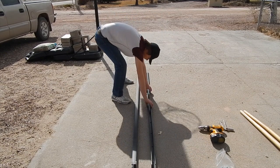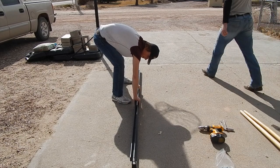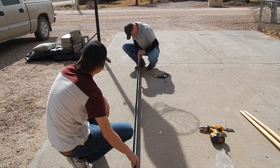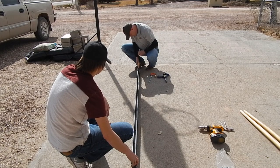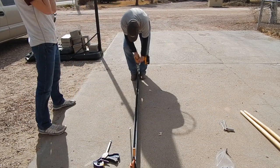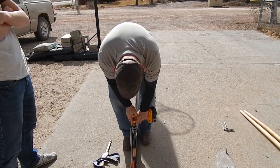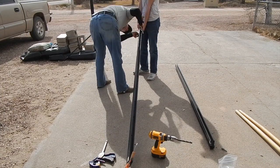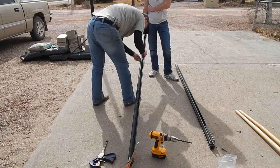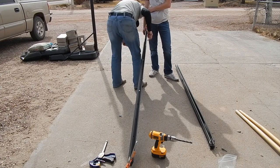The corner post will need drilled with a 3/8 drill bit and a cordless drill. Turning one post on its side and laying flush to its back, the top post, while creating the corner, use clamps to steady the materials. Then, with a cordless drill and a 3/8 drill bit, drill 4 holes in the system. After the holes are drilled, using the hardware kits that come in each Santa Fe fence section, connect the posts together with a 9/16 socket and ratchet wrench.